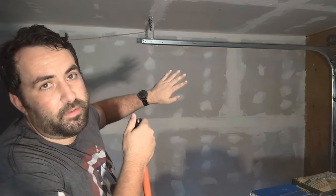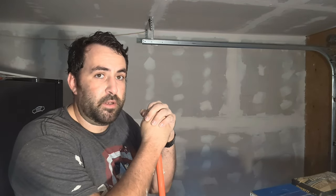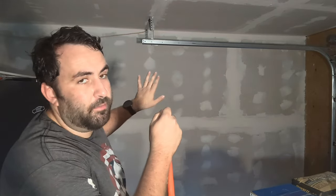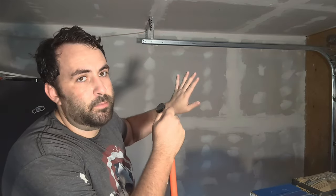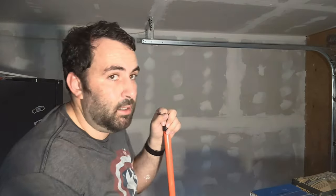If you're trying to go for perfectly flat, smooth walls, you've got to start at the framing stage. That's why all the finishers know who the best framers are — because if the wall's not framed perfectly straight, it causes way more problems: there are waves in the drywall and all that other kind of stuff. Anyway, back to sanding.